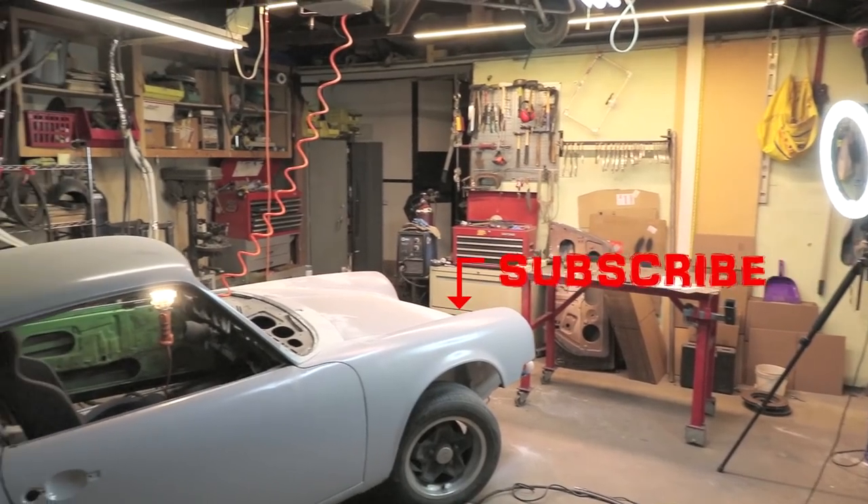Progress is progress. It doesn't look like I got much done, but I got the main hoop to fit the car better, which is key, and I got the tubes notched and welded in for the diagonal bar, and the base plate's planned out. I'm going to do a little bit more research on the harness bar before I notch those tubes. I also put some epoxy primer in that rolled fender edge that was left as bare steel, and did a little touch-up primer in the back where I did some lead work on the reflector panel. Hope to do some more body work over the weekend. See you next week — take care.